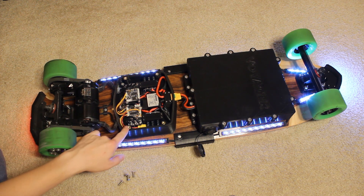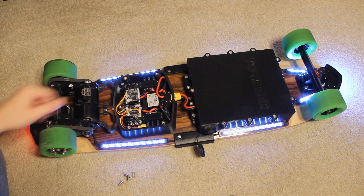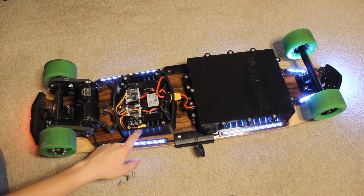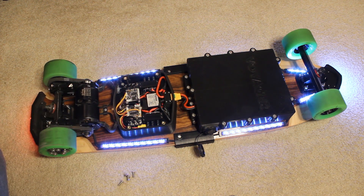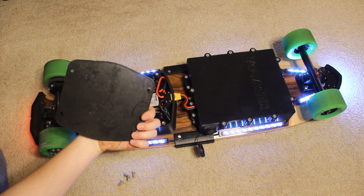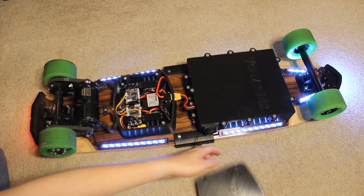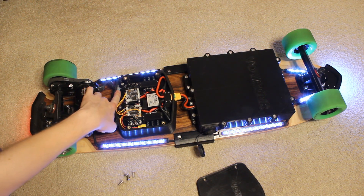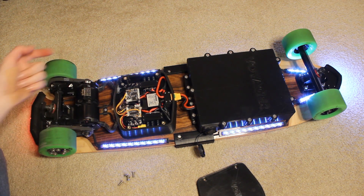This enclosure uses heated inserts so you can remove the lid relatively easily. There's also a rubber gasket — a 2mm O-ring that slots through the entire case — and the back of the lid has a mating surface for it, which keeps the dust down. It's not totally dustproof, but definitely better than nothing. The wires at the back are hot-glued in place for structural reasons, and then I use window sealant to keep out as much dust as possible, though occasionally I'll need to crack this box open and spray it with compressed air to clean it up.